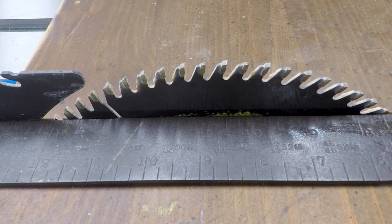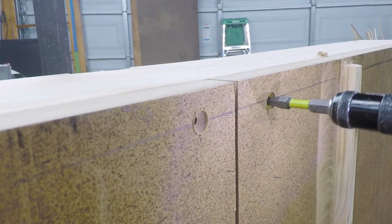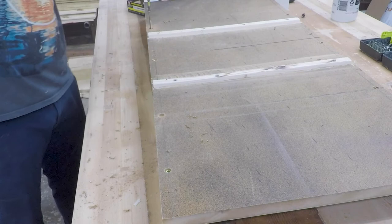And after making that giant mistake, I checked for square again, and what do you know — it was square to the blade. I then repeated the same steps for the back support, not really dialing in for square, as this will not be a reference for any of my cuts. And for those of you who stuck around to see if I realized my mistake in time — thankfully I did. The middle screw I used to align the fence was right in the path of my blade and could have been very dangerous as the saw tried to dig into the full length of a two-inch screw. Even if I didn't lose an eyeball, I would probably poop myself from shock and would most likely need a new blade. So I drove some screws on either side, and that should help me keep my fingers and my sanity.